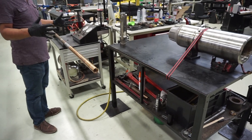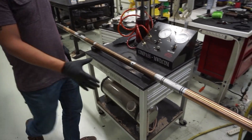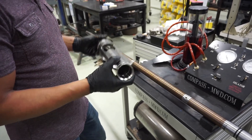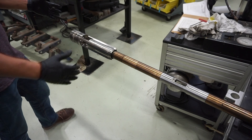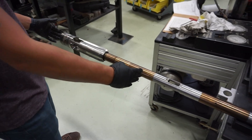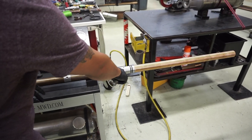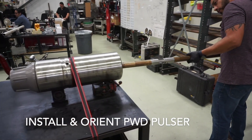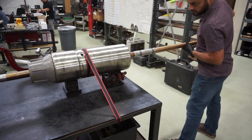In the assembly below the PWD, the sub will be a pony sub. And below that pony sub will be the UBHO sub. The UBHO sub is what holds the UBHO sleeve that orientates our tool. This is where the sleeve number goes — onto your lower end. Imagine this sitting inside of a UBHO sub, so it's going to be sticking out further up here. Then the pony sub goes somewhere in between, and then the PWD sub will sit here where the holes line up as well.